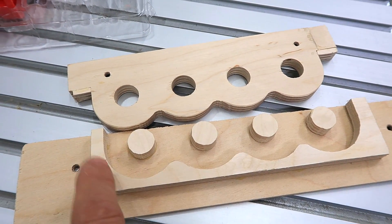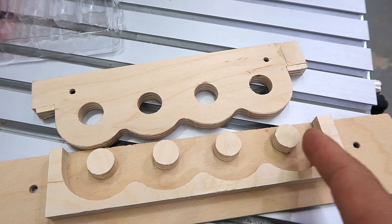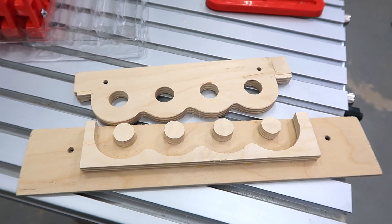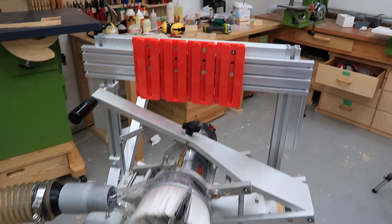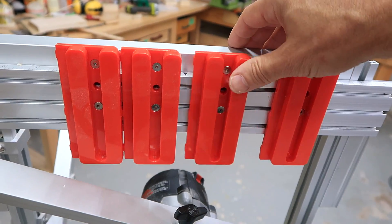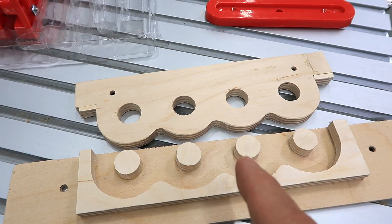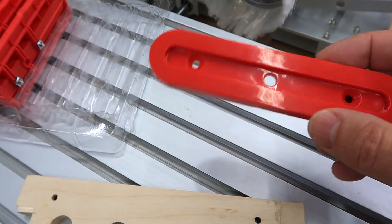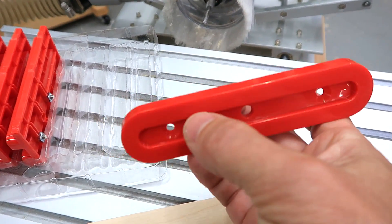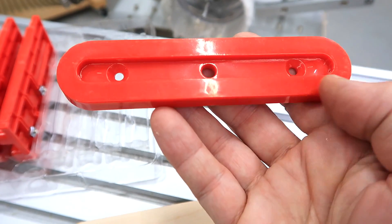The problem with this template is it has an end on both sides, so I can't really use it with just three pins because I won't have the ends. The idea is to make a segmented pantorouter template like this box joint template where you can add as many segments as you want for how many pins you want in the joint. To avoid needing two sets of templates, the idea is to have one template like this mortise and tenon template where the inside is for the mortise and the outside edge is for the tenon.